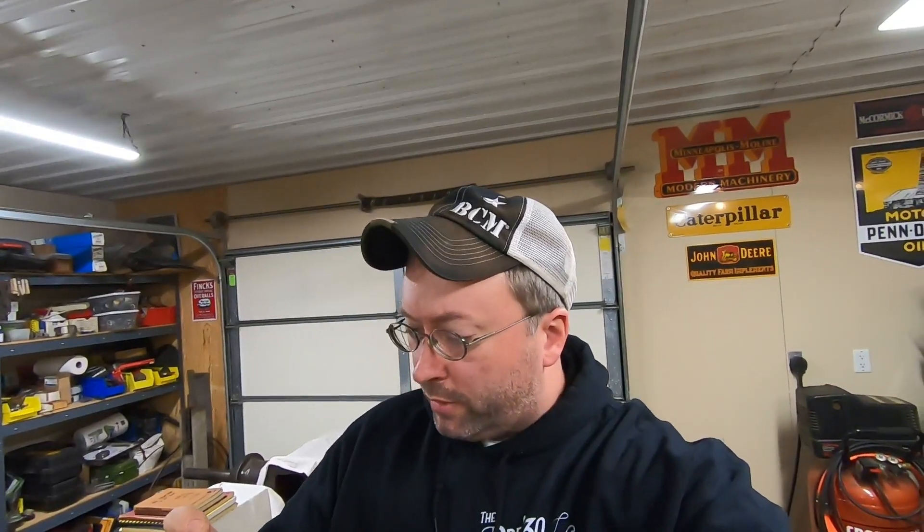EDB is probably an international treasure when it comes to knowledge about these old Caterpillars. He apprenticed on these engines, spent decades in the dealership working on them, worked in the engine shop, did the fuel injection stuff — this guy has forgotten more about these engines than I'll ever know, with decades of real-world experience. He writes: 'A good question. I once asked that question at the dealer in the early days of working in the engine rebuild shop as an apprentice. And I was told it was because you can have loose soot, water, and other crud in the exhaust pipe and manifold. The exhaust system is basically unfiltered air that water can sometimes get down the pipe to, and some of that crud would get drawn into and out of each cylinder via the dirty exhaust system. Whereas utilizing the inlet system, the air transferred in and out of the cylinders would essentially be clean.' EDB, you are an international treasure.